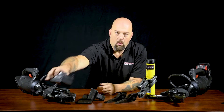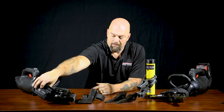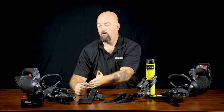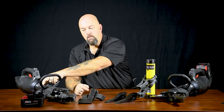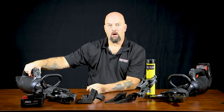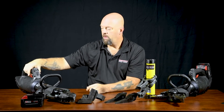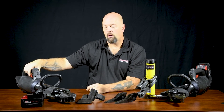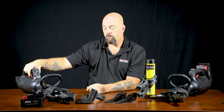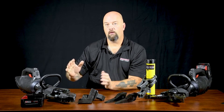The tool itself is powered by the Milwaukee 28-volt lithium-ion battery, available in either 5 or 3 amp hours. Moving on back to the tool: rotatable handle, also removable, LED lights on the front and rear of the tool, off-on is on the top, the Genesis rocker switch, which allows for fine motor skills of your forefinger and your thumb rather than the gross motor skill of a twist control. It's also a variable speed controller where you can feather it and control the open and close of the tool. And one last thing — a dead man control, so when you let go, the tool stops.